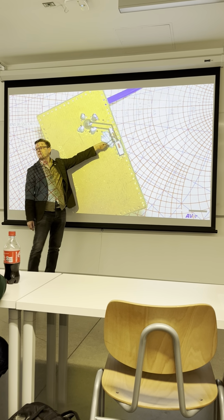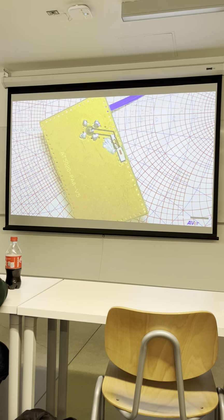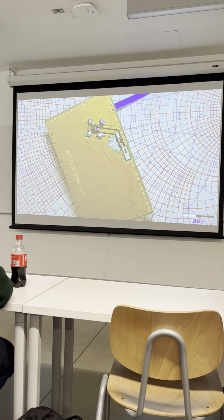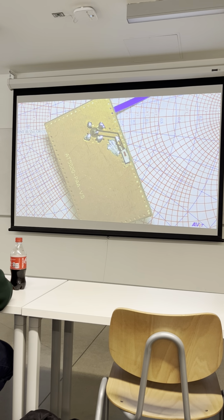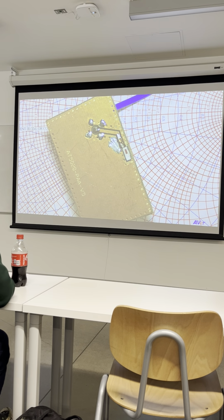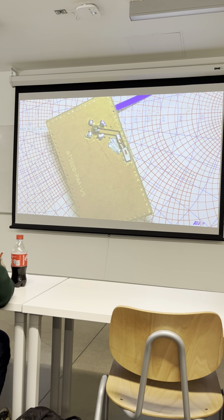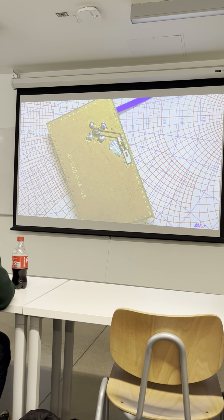There was an open here, because you would put a series component and then a shunt. And you'd have an L network, right? The same thing we've been talking about. So I guess you wouldn't need this one. But technically you've got room, you can squeeze something in. Obviously all of this is ground, so that's the other side of our other conductor in our transmission line. This isn't technically microstrip, it's called coplanar, because the ground and the signal share a plane.